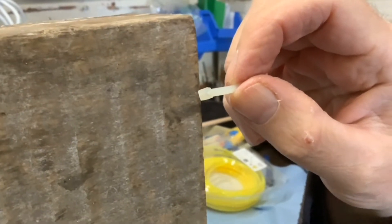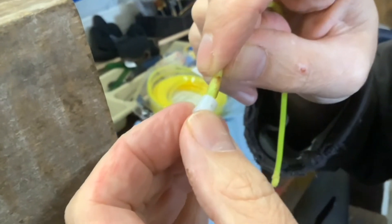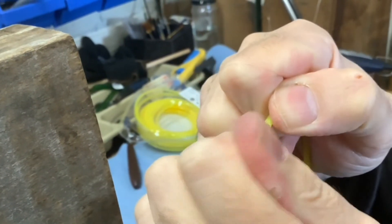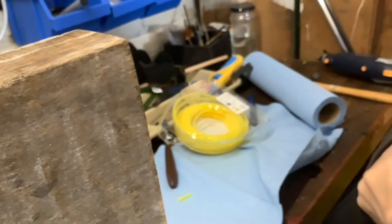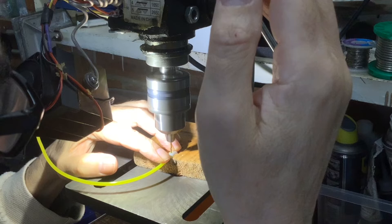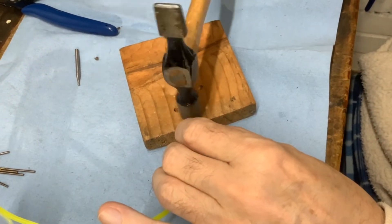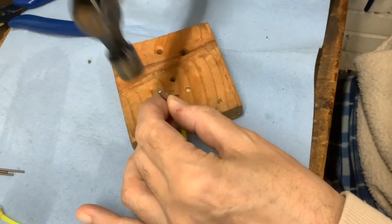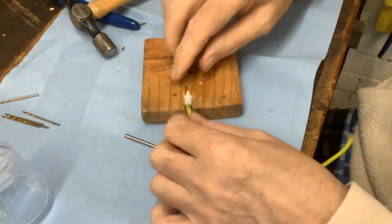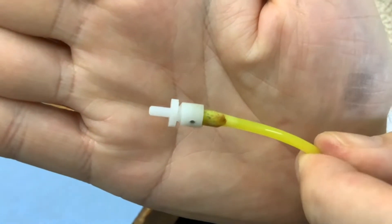That's the original — broken tail with a cube on. Here's the one we've made: it's a bit melted, a bit scorched, but it's the right shape. The nylon piece of line with its squared end pushes in there. All that remains is to drill a hole through the original hole of the white bit and drive the pin back in. Using the pillar drill with a tiny drill bit for accuracy to get it completely straight. Then the small metal pin is driven back through the assembly to fix it all together. There it is, finished. Neat job, Paul — let's hope it's strong enough.